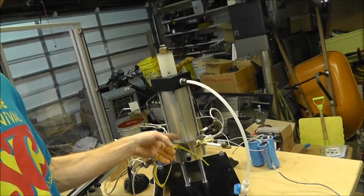They are formed. And I made two separate coils instead of one coil. And the reason I did that is because I want to be able to change the states between different stages of this piston moving up. I really don't have the ability to do a whole lot with that, but I thought if I'm going to wrap that much copper wire, probably about $75 worth of copper wire, and encapsulate it in epoxy, I might as well make two separate coils. I can energize them at the same time, and it gives me the exact same effects.